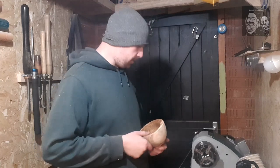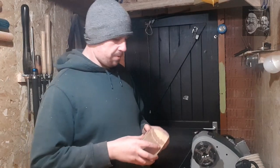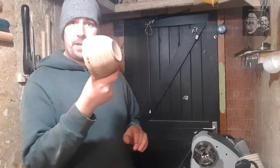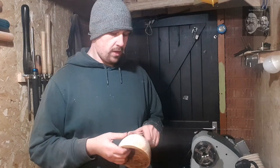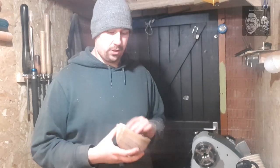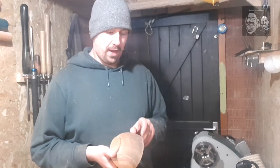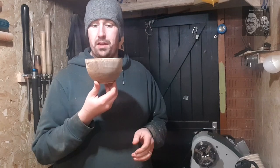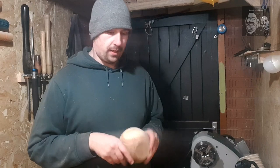So yeah, really quite happy, and I'm looking forward to doing another 3 month, maybe 6 month video review of how it's been doing over a decent period of time, over a decent amount of use as well. Obviously, this piece will just go into the shavings that it came out of for a couple of days, let it slow down the process of drying, then I'll slap some PVA on it, get it weighed, get the moisture checked, and then that'll be another 6 to 8 months or so before it even gets looked at again.